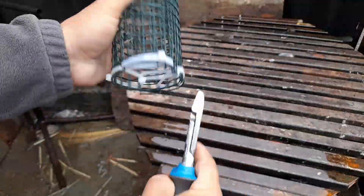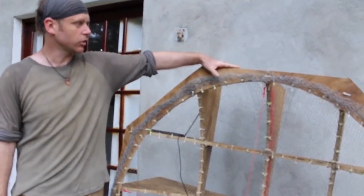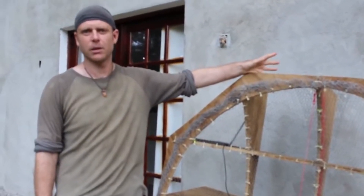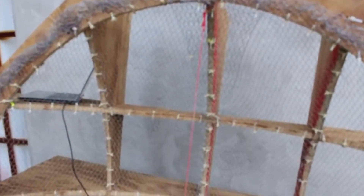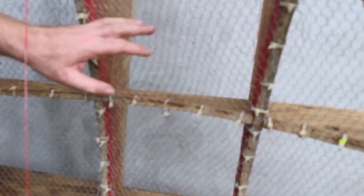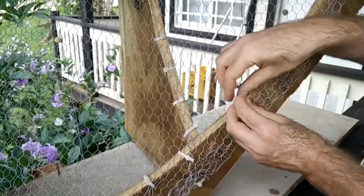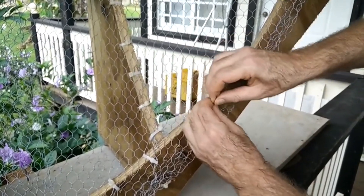I'm going to show you what I'm going to show you. The dish is just made from some standard normal plywood — marine ply since it's jungle, so it doesn't rot, but if it's not going to get wet it doesn't need to be. We've got small cell chicken wire in here, which is just standard chicken wire, and then just zip ties to pull that mesh tight to the paraboloidal shape.